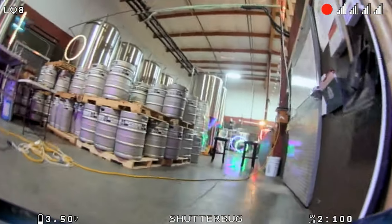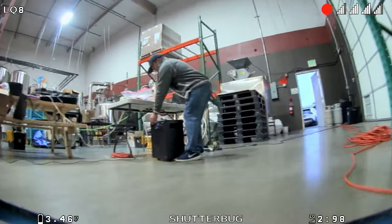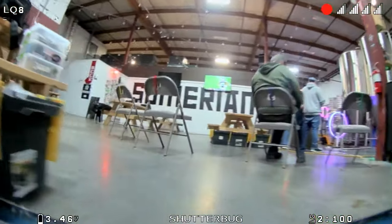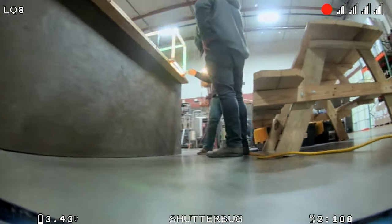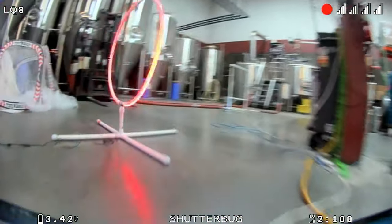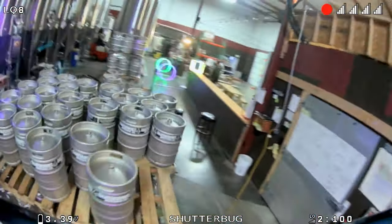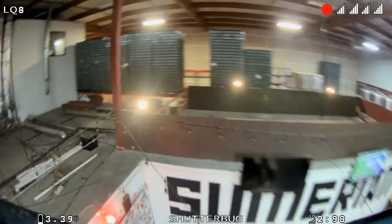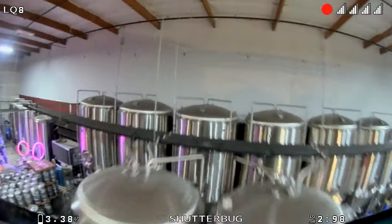As usual, you will sometimes see little sparkles or blocks of data that are missing from the picture — that has nothing to do with the camera. That has to do with data that's lost in the radio transmission. The HD0 system chooses to let you see that so that the rest of the picture can be presented with correct timing instead of retransmitting data. You will see some of that in this video, but I was pretty impressed with the reception. This is 25 milliwatt, there's at least one other pilot flying, and the environment is made of concrete and stainless steel everywhere — a really rough environment for RF — but when you consider that, this is actually pretty clean.